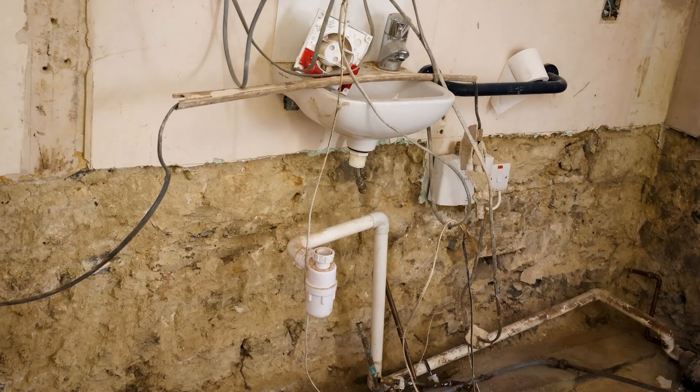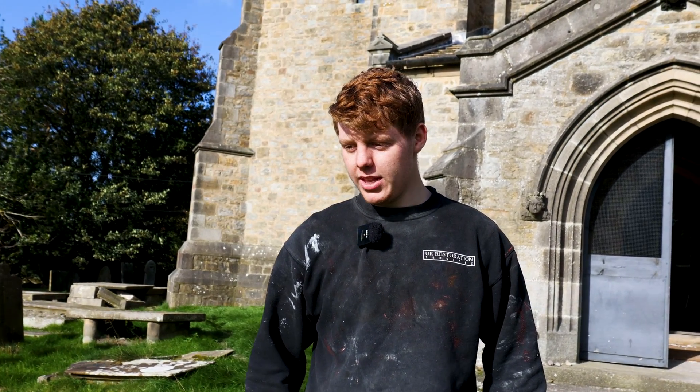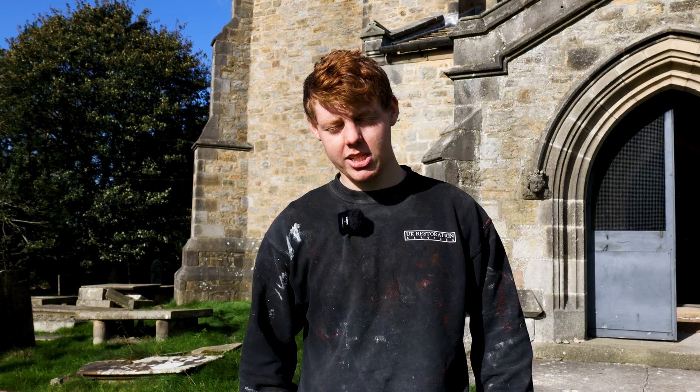There's going to be a meeting soon with the architects to decide what to do. If we reinstate some wood there's no guarantee that dry rot won't take hold again, so it could be anywhere from limecrete in the floor to concreting it — it really depends on how well ventilated the room is.